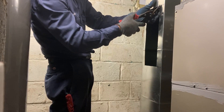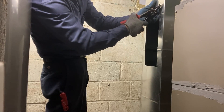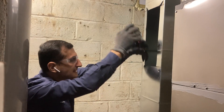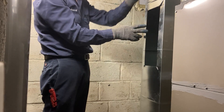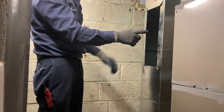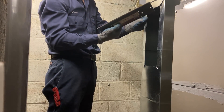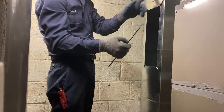Usually what I do, three-quarters of the length of my snips just works fine, and it should go in at a 45-degree angle compared to any of them. After making these cuts, now it's time to make the drives and slips. Here is a caveat: you have to first bend your drive sides, then bend your slip sides. The reason for that is we're going to bend this at 90 degrees, and because my clip bender only has certain sizes — 12, 18, 24 — it won't fit because this is a 7, but this is 14. I can slide this later, and when I'm done I will explain.